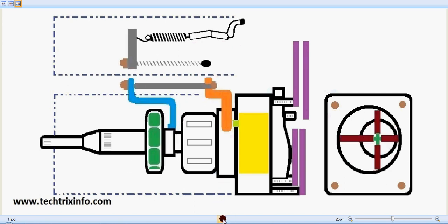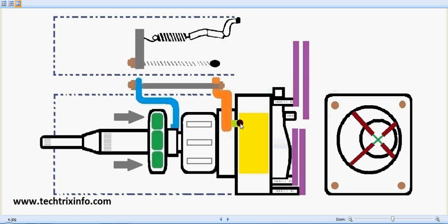So these are the two factors controlling fuel flow to the injectors: first, the drive shaft drives the vane pump and the governor retainers move automatically according to engine rpm, moving the governor arm and controlling the metering valve and gallery to supply fuel to the injectors automatically. Second, when the driver pushes the accelerator manually, the governor arm and metering valve are controlled by that demand. That's simply how a fuel injection pump works internally. Thanks for watching — have a great learning experience.